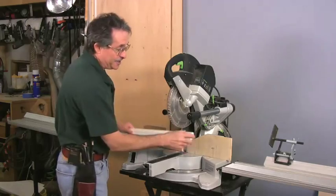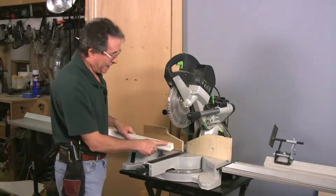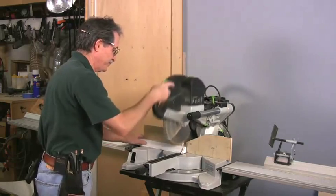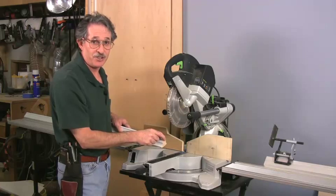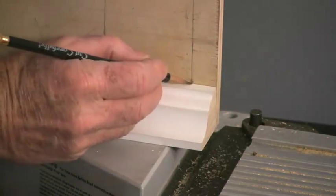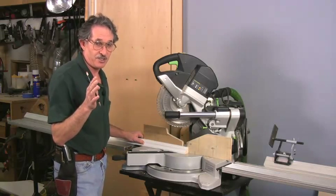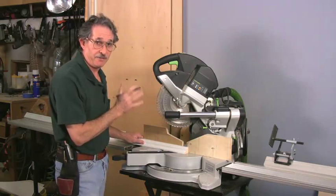Since we've turned the crown upside down, this end is really the left-hand end. The left-hand end on the very first piece needs a butt cut, so I'll cut a regular 90 degree butt cut. The next corner is an outside corner and this piece has to measure three quarters of an inch to stretch across the edge of the pediment. I'll flush it up with my fence, where I've got a three-quarter inch mark, transfer that mark onto the piece, and make the cut. I'll pull the saw in this direction to get everything lined up before I start moving along quickly.